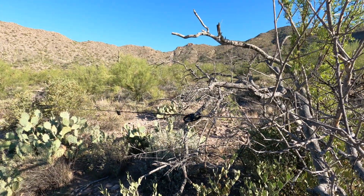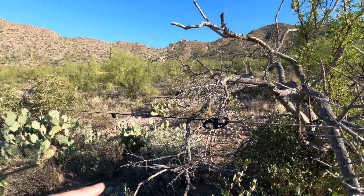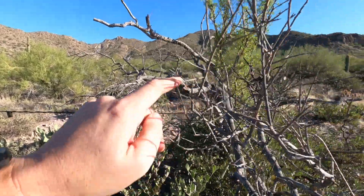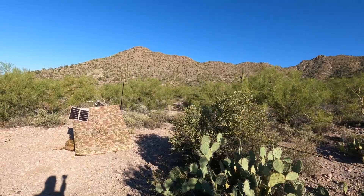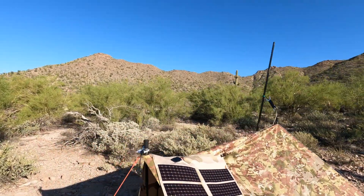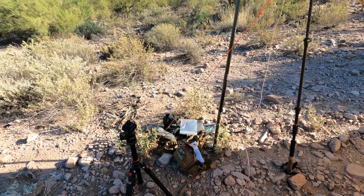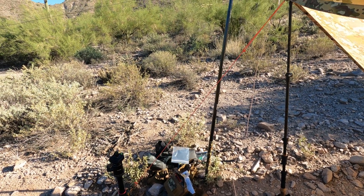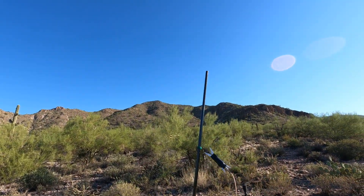Let's go ahead and take a quick look at the camp and radio system set up for today. Out here I'm at the furthest position, about 33 feet out — this is where I have the end of one of the legs of the dipole connected. I'm using S-clip carabiners, overhand knots, and in this case I didn't even deploy my trekking poles, mostly because I had a bush nearby. We're only at 4 feet. This is an NVIS deployment on a 40 meter dipole I built just before this outing. The support for the center mast is my Carbon 6 carbon fiber mast, staked in with a small 12 to 18 inch camping stake, and I only have about 5 sections of the mast so it ends pretty short.